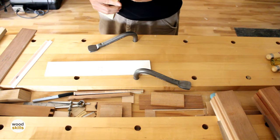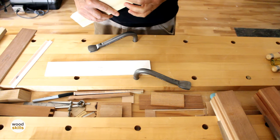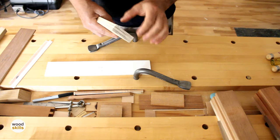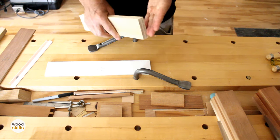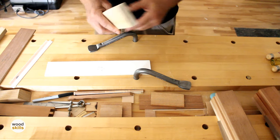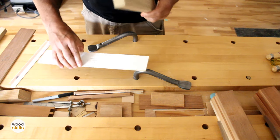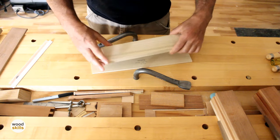The other shoulder needs to be approached a little differently because it's on the opposing side of the component. I switch back to the cross-cut version first, then switch to the rip version. You'll notice the saw slides right into the kerf — that's because the spacers are identical in thickness on both saws, which is part of the design. That's very important when alternating between two of these saws. Once both cuts are established, you can see the full width of the tenon. The next step for this component is to extend those cuts to 45 degrees and then cut the shoulders. But first I'll perform the same process on the mortise board, replacing the tenon spacer with the mortise spacer.